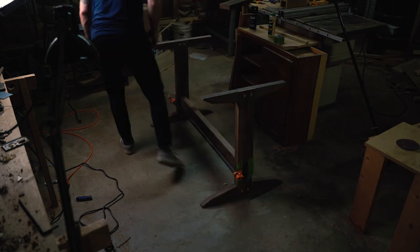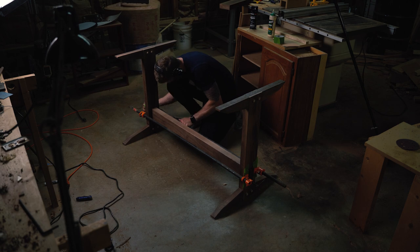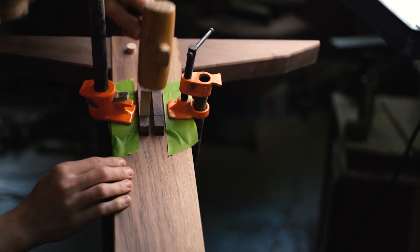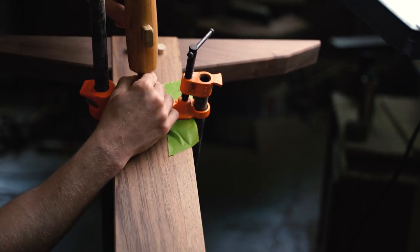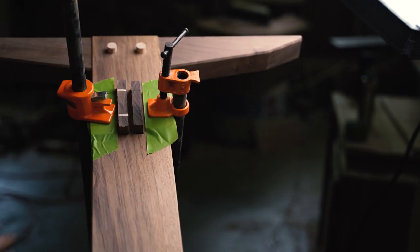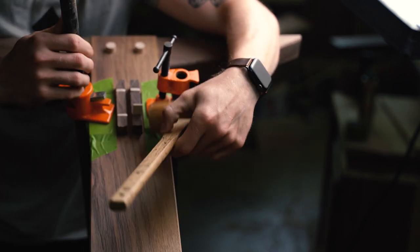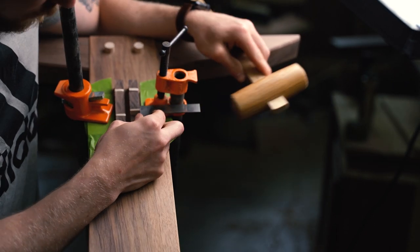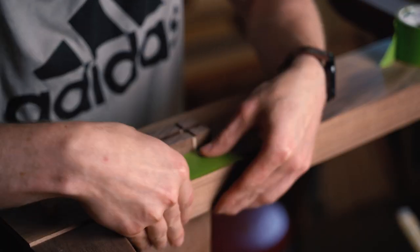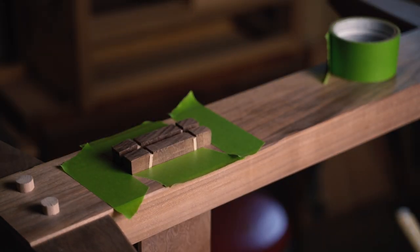The tape you can see there — I've actually cut a couple pieces of leather, and this is a really good tip: when you use clamps like this, use some leather to soften those clamps because they really do leave dents if you don't. I also put just a very small amount of glue on this joint. I didn't really need much because that internal dovetail really just pulls everything together anyway. Maybe if I was building this for a client I would use more glue, but I just don't like cleaning up glue. I would still be comfortable parking a car on top of this thing — it's super sturdy.